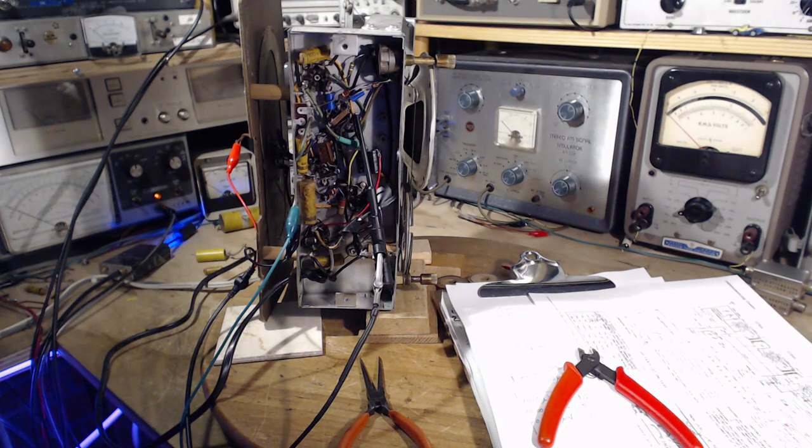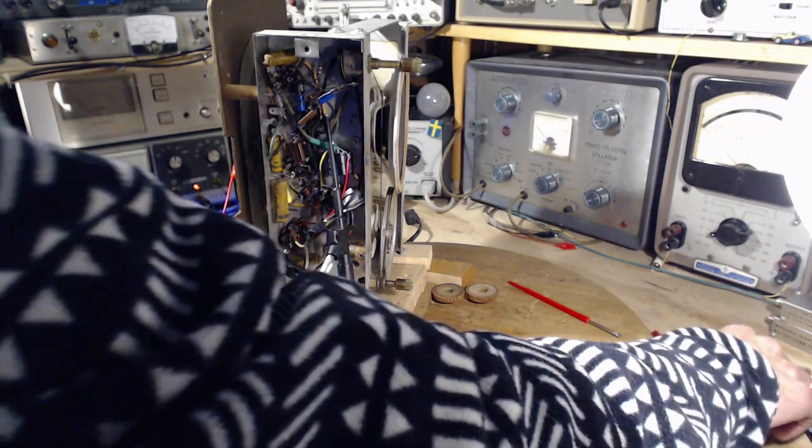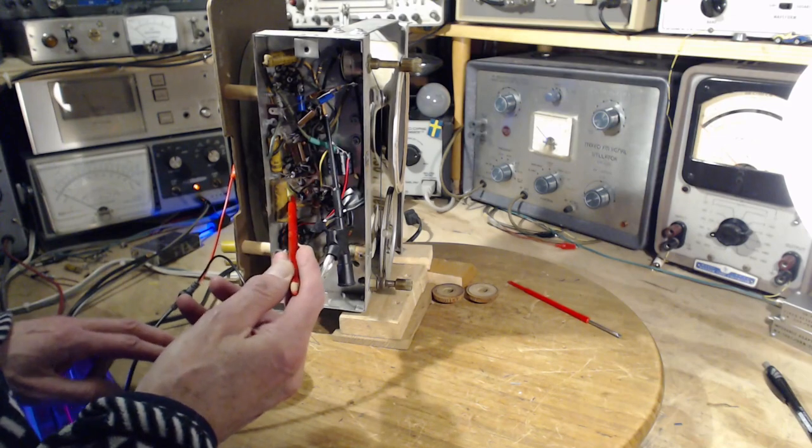So it's a little hard to see the detail in the camera - the eye didn't just close, it actually overlapped. So that's telling me at 50 volts it overlaps - she's a dud. Now how would this be enough to interfere with the operation of the AVC? Well that's what we're trying to find here - it would leak in there. We didn't measure its capacitance - my experience is a very leaky capacitor, you can't measure its capacitance accurately. So I'm going to stick a nice new 0.05 microfarad capacitor in there and we will test again.